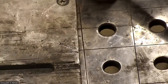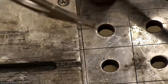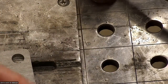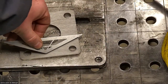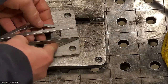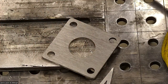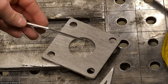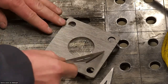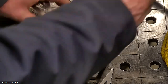I'm set up with my normal wire feed setting for this material. I have about 11-gauge stainless and some thicker stainless as the flat piece to weld to. My machine is set for roughly 80-thousandth material even though this is a little thicker, because I'm going to be going a little slower. I want my power down a bit from the recommendation, since that power setting assumes a nice fit-up going straight. When you're manipulating the torch and going slower, you want a little less power.